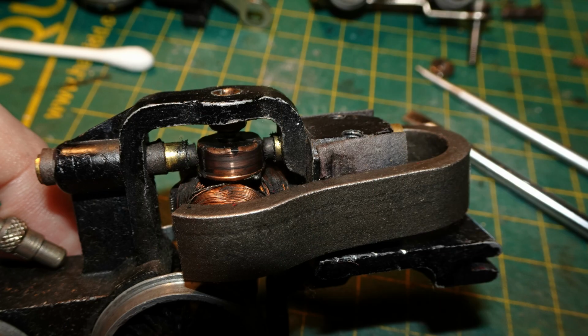The magnet had not shown the slightest sign of moving even after I removed the yoke holding it down, but now I really wanted to remove the magnet so that I could get the armature out. Ronald Dodd suggests perhaps spreading the ends of the magnet beside the commutator, but that seemed a bit risky. I just gently levered the magnet up at back and centre, starting with a very thin screwdriver and then using a larger one once there was room. The fit was very tight, and quite a bit of levering was required to shift the magnet.